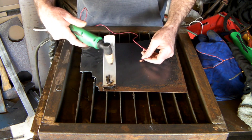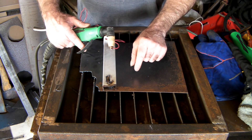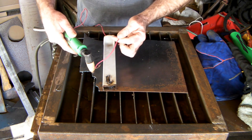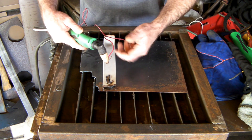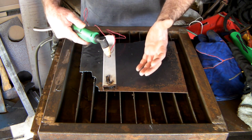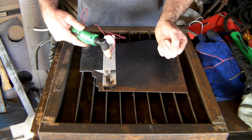This wire tricks the tip into thinking it's already touching whatever you're cutting, and as soon as you do start cutting the wire is redundant — the current goes straight from the steel through your torch again. That's how I use it, but I wouldn't use it all the time as a full pilot arc solution. It just gets you out of a hole really quickly and saves a lot of aggravation trying to get a grinder into places where you can't get one.